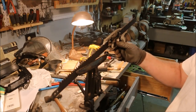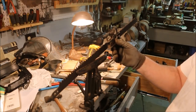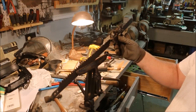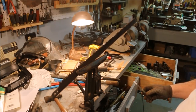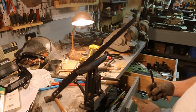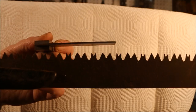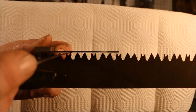Because the teeth are too small for this raker gauge to fit over — it does quite a nice job on a one-man or two-man crosscut saw — with this little buck saw, this is just too big for it. So I'm forced into using a feeler gauge and a straight edge. Set the straight edge flat on top of the teeth and try to slip it over the top of the raker.